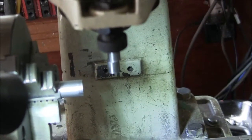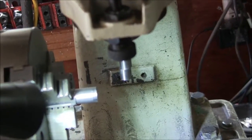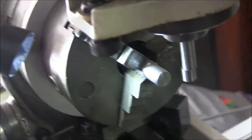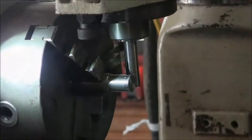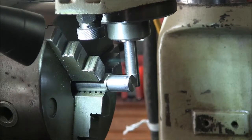Let me get the camera set up. Got the edge finder and the mill. We'll get to milling four 90-degree flats on this piece of bar stock. We got the piece chucked up in the rotary table, and I got my center finder in there. I'm just going to find the edge of this thing. I know that the flat wants to be 400 across the face of it.